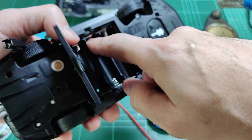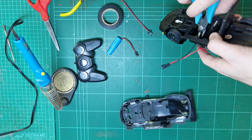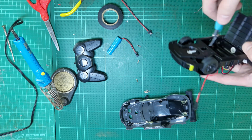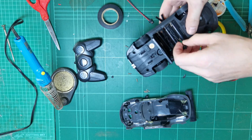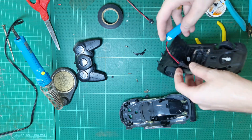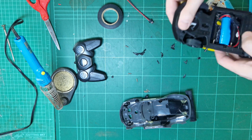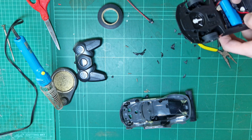We're going to have to make a hole in the battery compartment to feed the battery connector through — this is where we use our cutters to cut a hole in the battery compartment. We also need to remove plastic to fit the batteries, as the rechargeable batteries are a little bit bigger than the double-A batteries. If you remove the contours for the double-A batteries — remove that plastic — everything will fit. It just takes a little bit of patience: remove a little plastic at a time, test it out, remove more, test again, until it fits perfectly and the door can close.